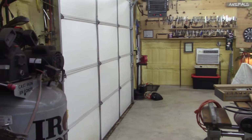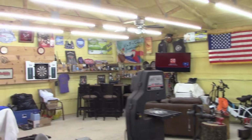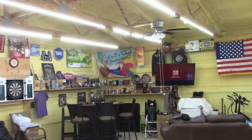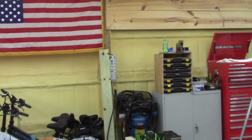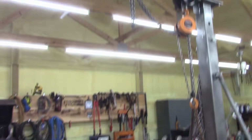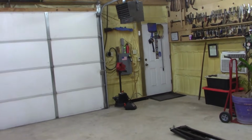RGE2410. Like I said, it's not a real big shop. It's 30 by 40, and it's metal skinned, and if you look real close, it's 6 by 6 posts, and it's framed. It's actually well built. They did a very good job. The guy that poured the concrete did a good job.